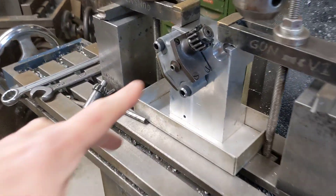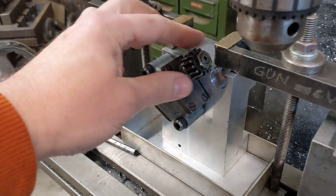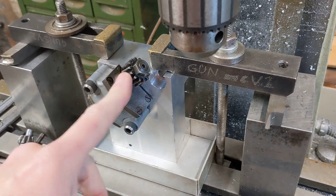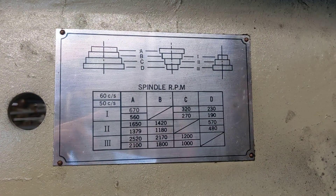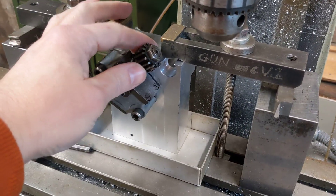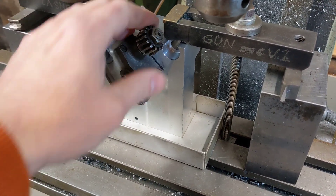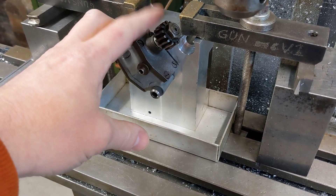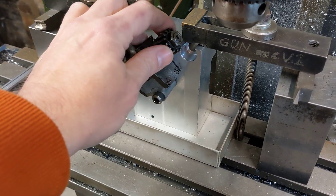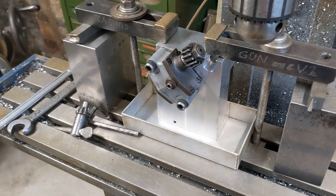When this is running, I'll post an update with the pump being spun around and the oil going around, and let you know if we need to do something about it. One last thing: if at 200 RPM this isn't running fast enough to draw the oil up, we can change the speed on the mill by changing the pulleys and find out at what speed we do need to run the pump. Then we can change the worm and wheel gears to a set of skew gears without too much difficulty, giving us perhaps a two and a half to one reduction ratio or even one to one if needed — so we can drive the pump at different speeds relative to the engine.